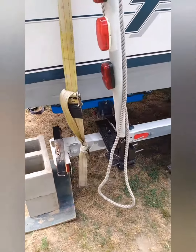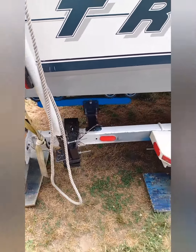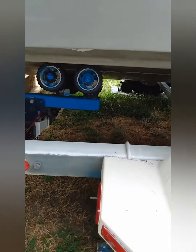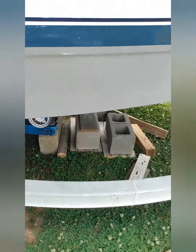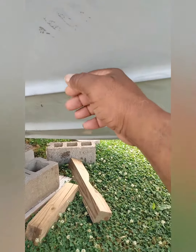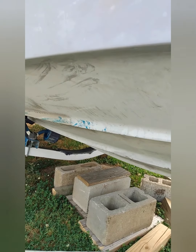Now, in this hull video, you see the flat part of the back of the boat, or the rear, for those that don't know nautical terms: the stern is basically flat. But underneath, it's not so flat, right? It goes down to a deep V, but it's flatter on the outside. As you come around toward the front, it slopes and becomes a deep V. Those edges under here, this stuff here, is called a strake. And we're going to explain the purpose of a modified deep V hull and what purpose the strakes have.